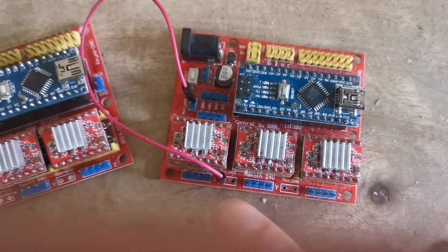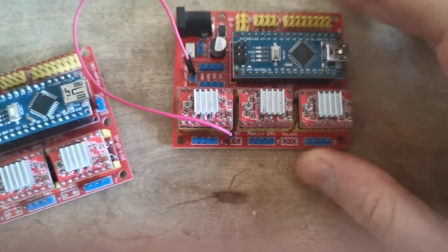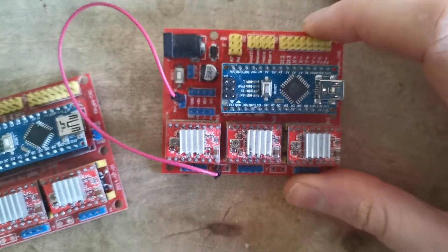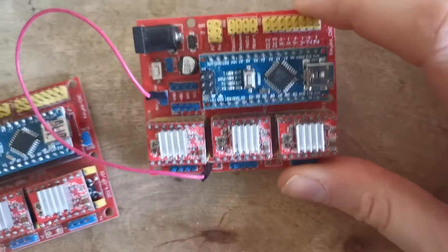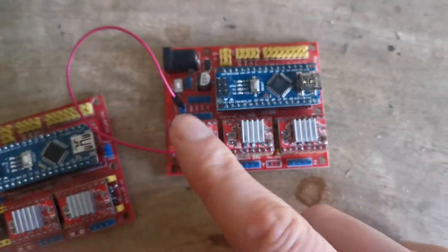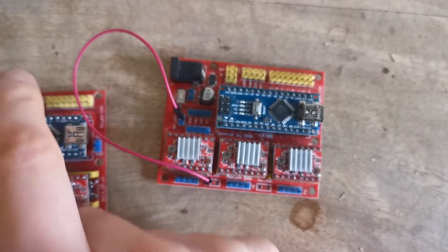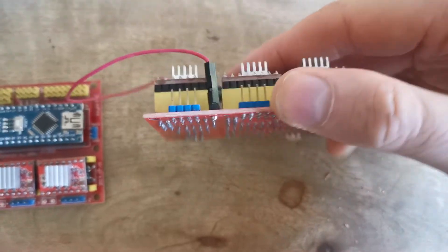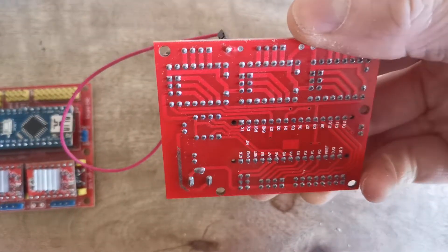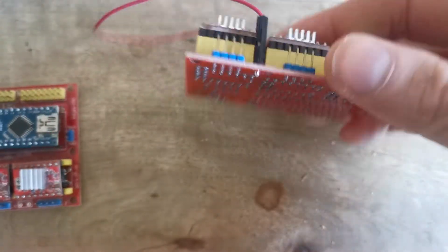You'll actually be able to get power to the board and power it up again, and it will work fine depending on your luck. So rather than buying a new board, it's worth trying this fix. It's quite an easy fix — just solder a little pin in here. I've soldered a pin in there quite neatly, and that allows you to power the board again.